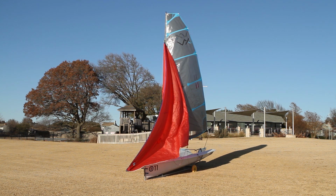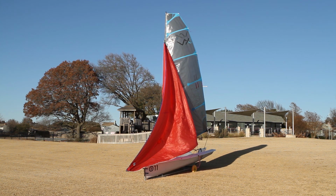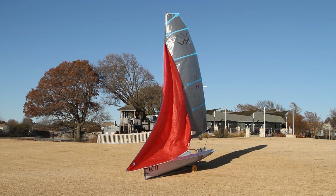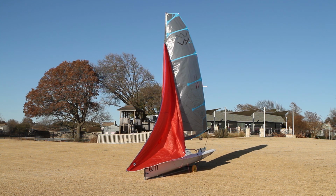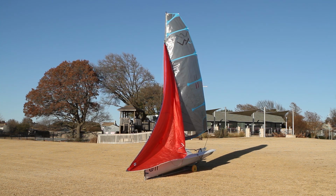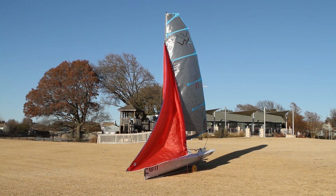Once we reach this point and we make sure that we're not going to run the spinnaker over with the boat, we pop the halyard off the cleat, as you can hear right now. And once again, the only thing that we have to do here is not really muscle, but speed. We just want to be a little faster than gravity as the spinnaker comes down, so we make sure that we don't have it going overboard and go shrimping, as we call it. So we're going to douse at the count of 3. In 1, 2, 3, and the spinnaker is coming down.